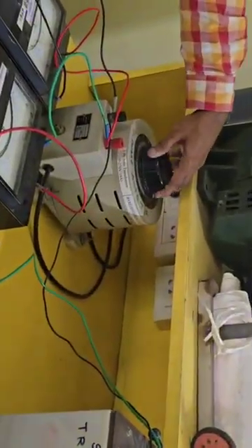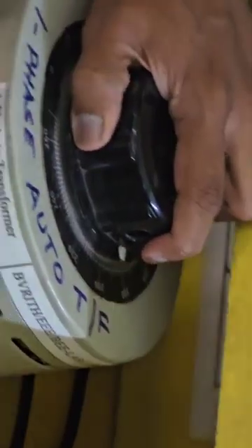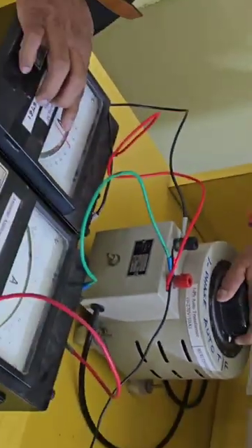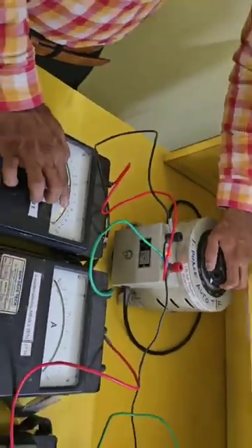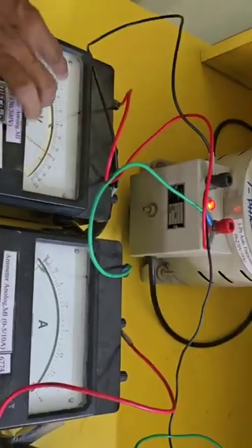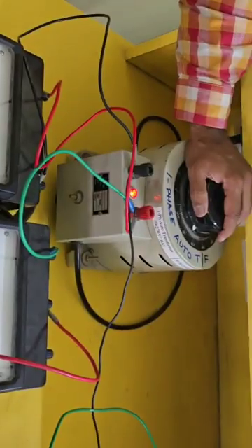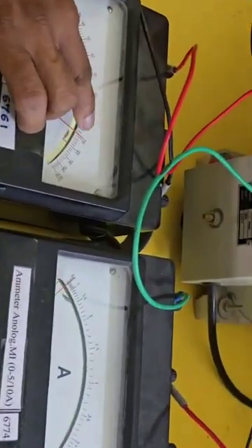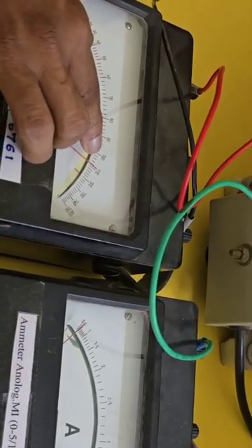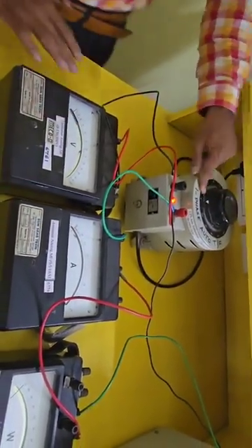It is very simple — how to give a supply of 230V here. As I connected to 300, you can see the meter. As I connected to 300, it will be between 110 and 120 on the scale, because 110 stands for 220V. Since 150 and 300 ranges are there, the scale shows 150, but I connected to 300, so it has to be multiplied by two. So between 120 and 110 means it is 220 volts, which means approximately 230-240V. That's why we use a voltmeter in parallel to it.